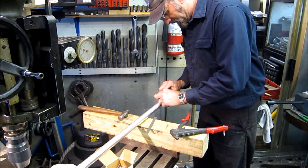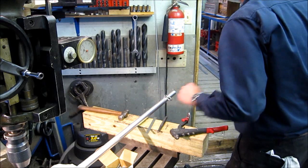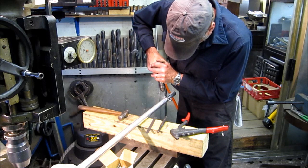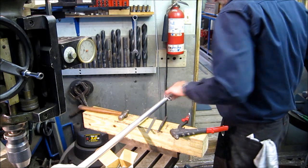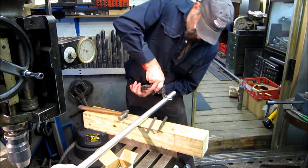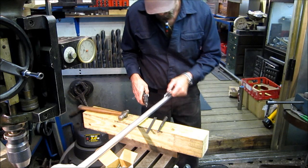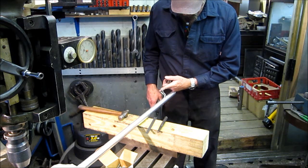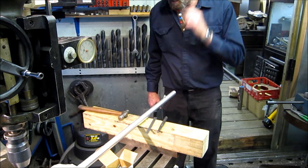Now after we get the first one in there, we get a good little straightness here, and we drill our second one. That way we're keeping the holes nice and tight, and there's no room for error. You can't pre-drill these holes. They gotta be custom drilled to suit. Alright. Now that's a stainless steel rope guide held on with 2 600 pounds of shear strength pop rivets, okay? That's not going anywhere.